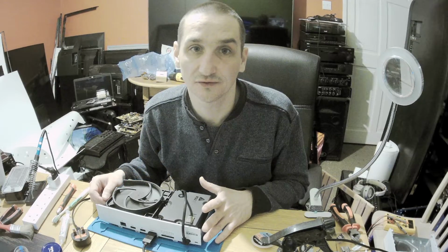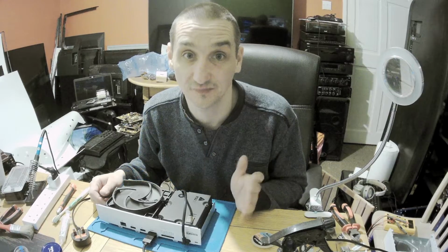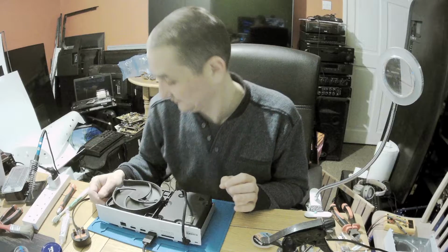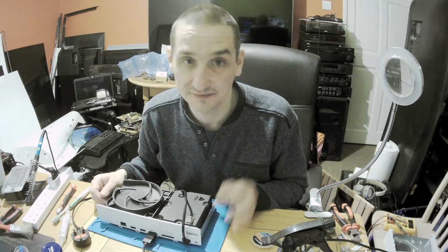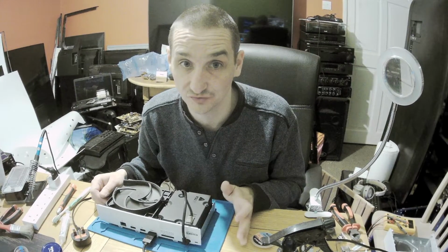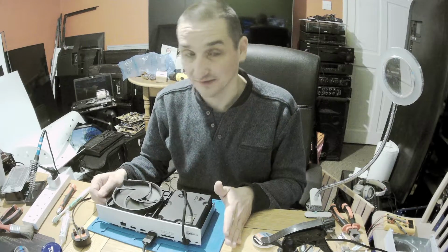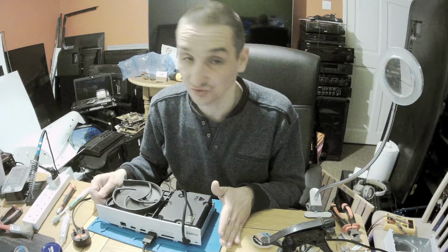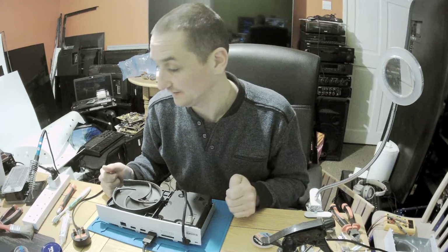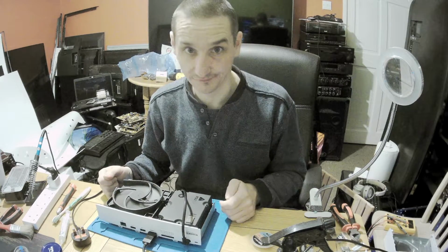So it's the encoder. That's the pin, that's the problem. If you would check the specification, the data sheet of the HDMI port, that's the sensing pin. And that pin was shorted to the ground. So the HDMI encoder was shorted to the ground. And that's no fun. Because if you short to the ground things which you shouldn't short to the ground, then it is what it is. So there will probably be a part two for this.